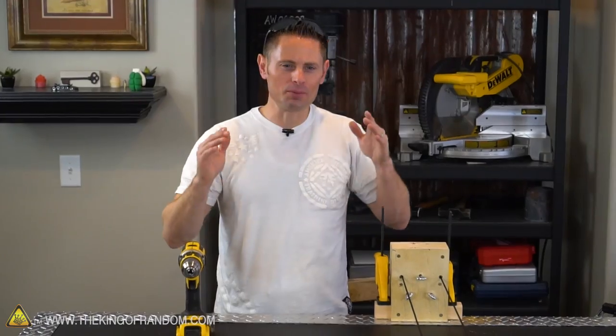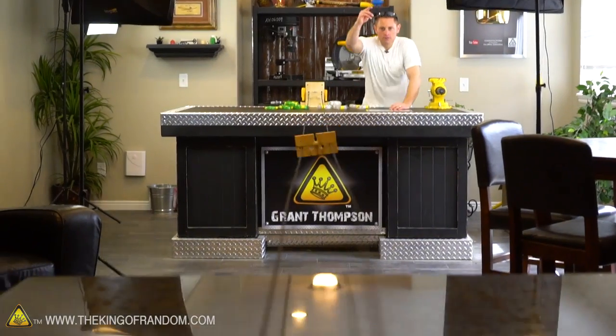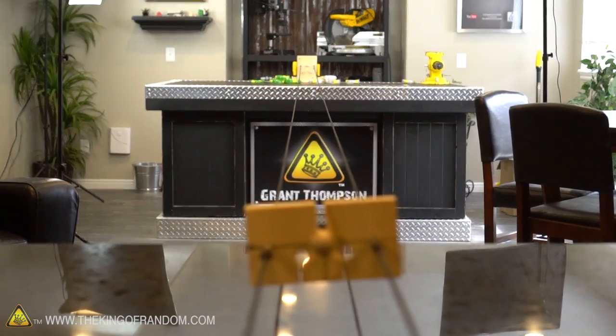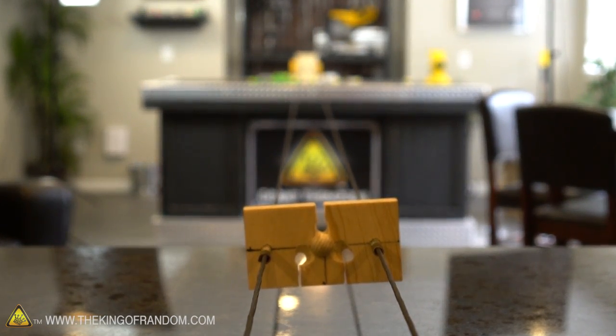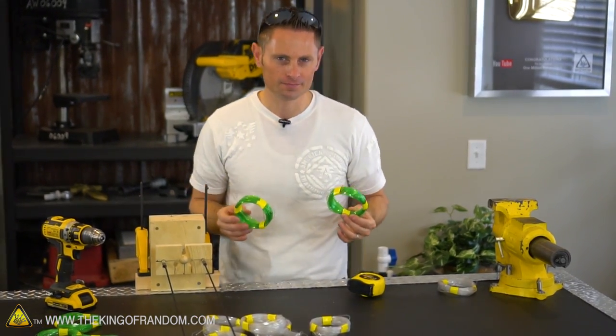So good news, guys. In a couple of minutes, we got our rope machine all set up. The guide wires are nice and tight, and the slider moves easily between both ends. So just for fun, I went ahead and measured out the distance between these two contraptions, and it runs about 22 feet. And since a 2-liter bottle makes about 95 feet of rope, we're gonna need about 1.5 bottles to make this length of rope here. And you know how it works from here.